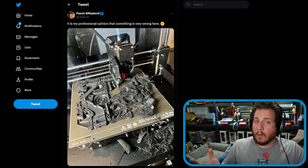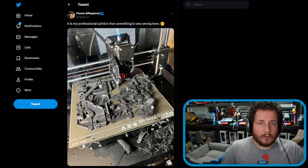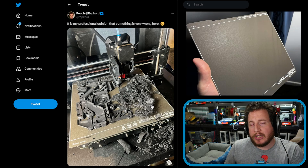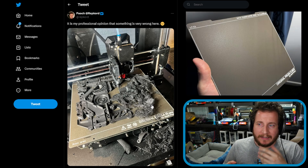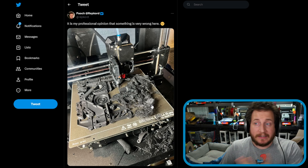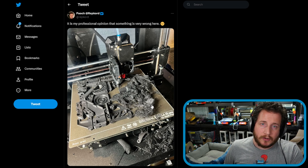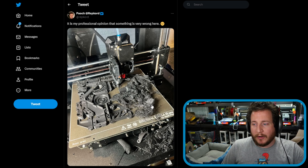On the textured plates, we find that alcohol, Windex, hot water and dish soap — good cleaning all the time can absolutely help. But if you are in a farm process, which Repcord often does, textured build plates are nice because they basically auto-release the parts. That's where the satin sheet from Prusa comes in, where it's a mix of both worlds. And unless you're in a high humidity environment, it seems to work quite well. I'm still a smooth plate kind of guy — I love the look of textured plates, but especially for open-air printers, smooth plates are just a little bit better.